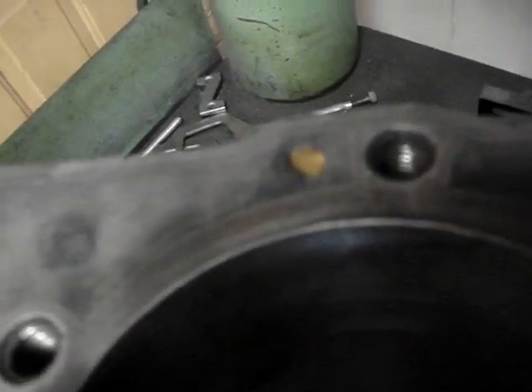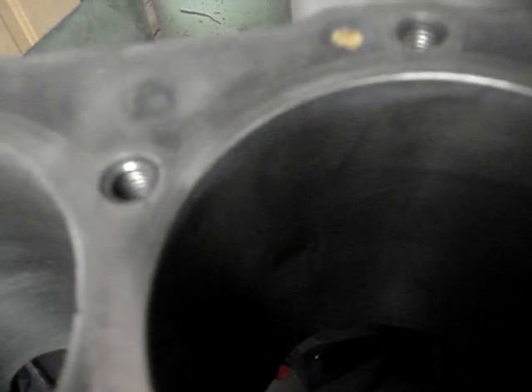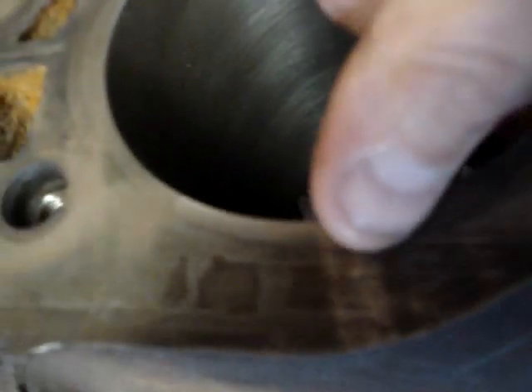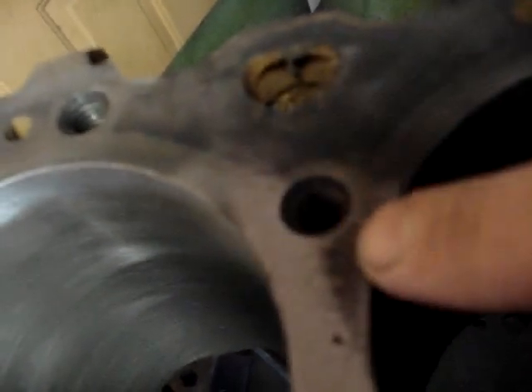We go to the other side of the cylinder — didn't even touch it. So we actually pulled minimal warpage off of this block when we checked it. You keep going back to this cylinder — didn't even touch here. But you can see that we've got a high spot here. It's shaved off about that much, and then it quit hitting. And again, this tool is going all the way across. So when you come down here, we got this area cleaned up, but the tool didn't even touch this fire ring area around this cylinder.